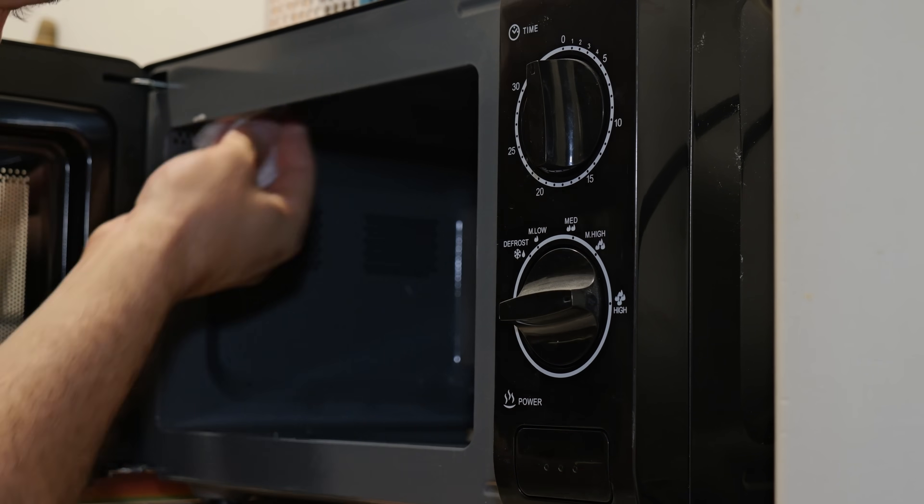No styrenes. But since I also know some of you are still going to try drying ABS and nylon, at least clean the microwave after and leave it open to ventilate itself. Hopefully we're not actually melting the plastic itself, just vaporizing the water molecules inside, so fumes and VOCs should be limited — but I'm definitely not a health expert or a scientist, and none of that stuff can be good for you.